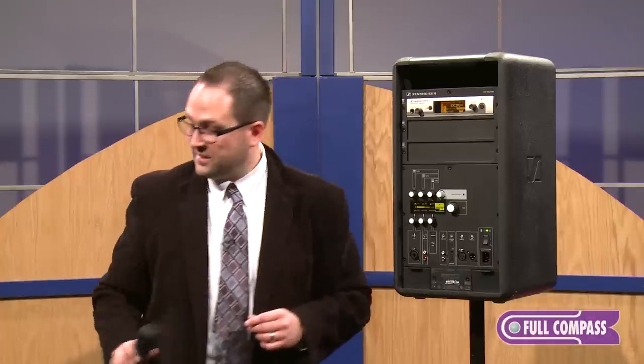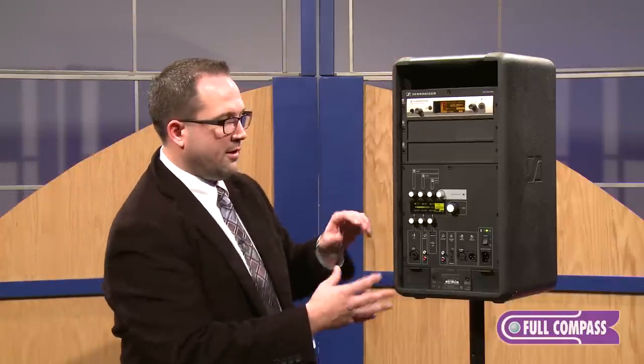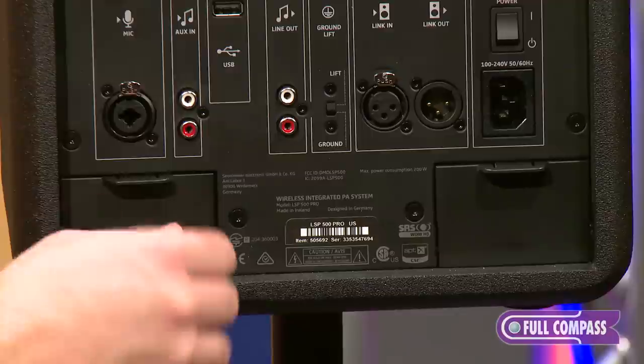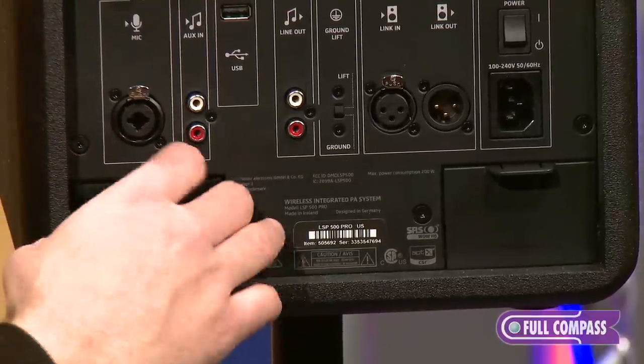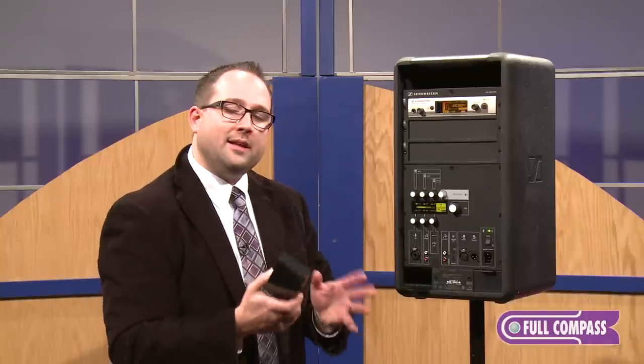It's a battery-powered system. On most systems of this nature, the batteries are an ATV or garden-style battery that you have to take the whole back end out to service — it becomes a real pain when you have to replace them. What we've done is standardize on an MP1-style battery that is hot swappable. You can get about six to eight hours of run time on a fully charged set, so your run time is only limited by the number of charged batteries you have on hand.